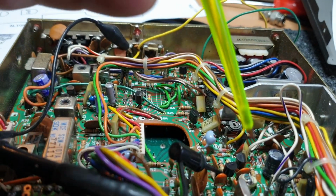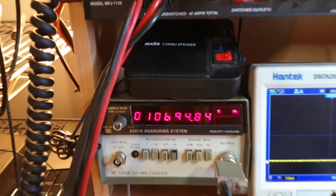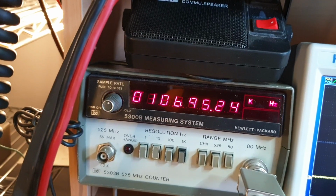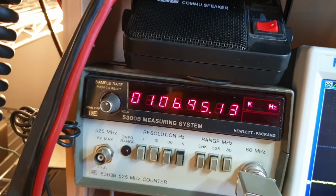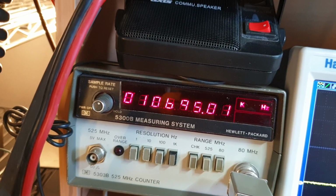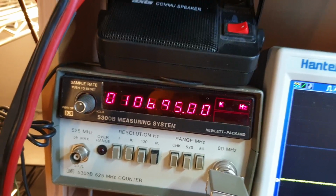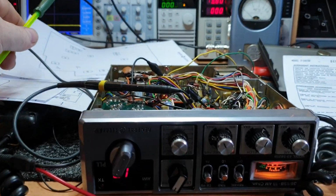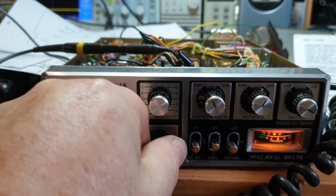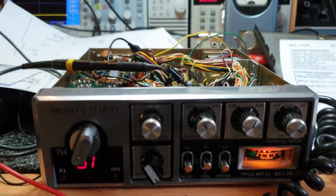10.695, you're going to be adjusting CT1. You're coming off that same emitter of Q4, and you're basically looking for adjustment to 695. And this is a basic alignment that should have been done earlier. I must admit, I took it for granted a bit. It's not that far off. I don't believe we've found our problem yet, by the way. Although, yes, we have. Look at that. Let's see our meter now on upper and lower. We have found it. Okay, so that's good news.